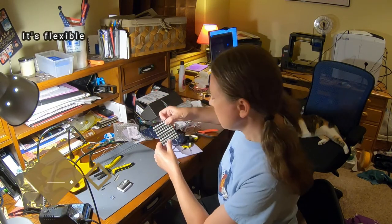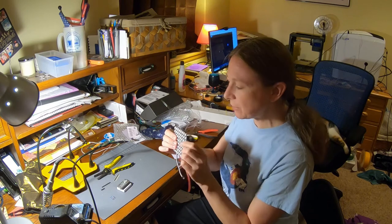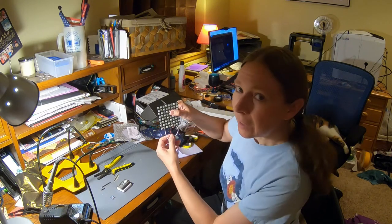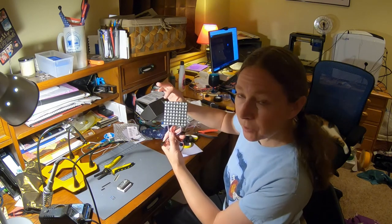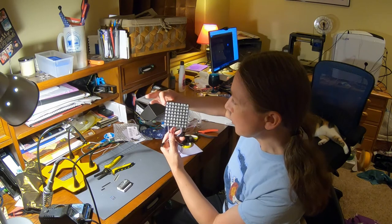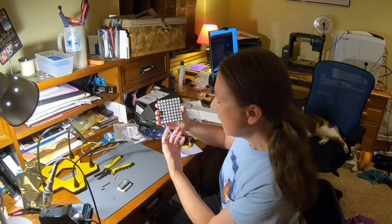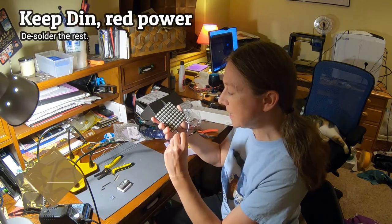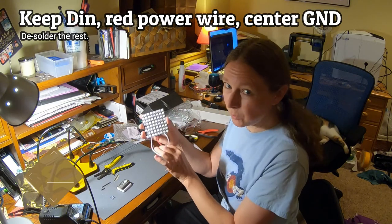To start making this mask, these are the supplies I ordered from Adafruit. First, we've got an 8x8 NeoPixel Matrix. It's billed as flexible and it is semi-flexible. It also has kind of sharp corners that can get caught on fabric, so that's something to be aware of. If you hold it with the wires pointing down, this pixel here is pixel 00, and then this one down here is pixel 77 — so eight across and eight down. The wires with the female connector are the input, your D-in wire. Connect that to a numbered pin on the feather; these are your power wires, and the rest we can desolder.